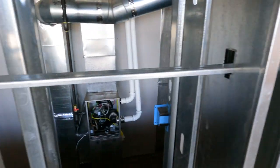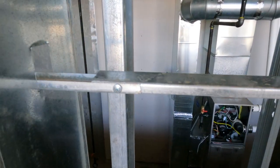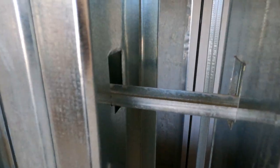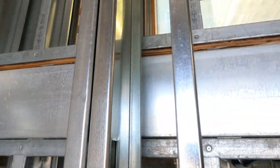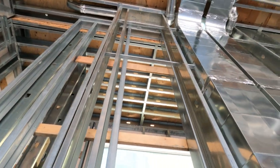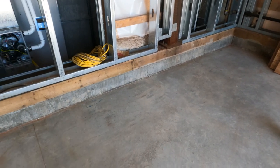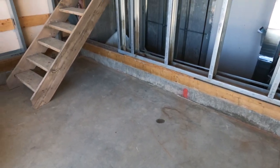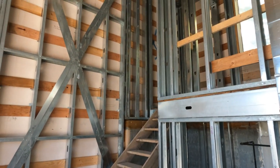You notice how clean it was when I first started — I swept everything and made sure it was clean so nothing would hit my scaffolding wheels, so I could move freely. See how I'm extending the channel into the double stud on the end? That way if you ever want to clip it, you have that length in there. You can clip the end so they don't move. If you leave it floating, the drywaller has to laser it in.